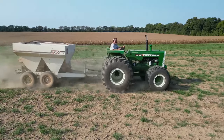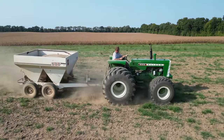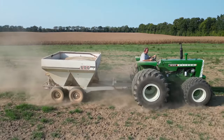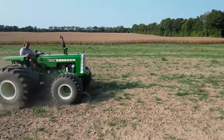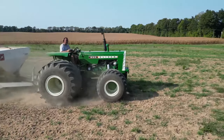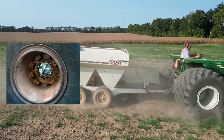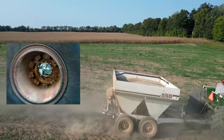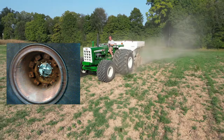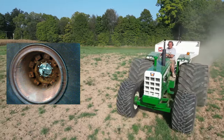But one of the things they did, I think when they switched it to the Allis-Chalmers 220, I should have a picture of that, is they added a second hub on the axle. It had to have been on the 220, because the 1650 did not have enough axle sticking out there to put two hubs on, especially the spacing they had it. But they welded a bunch of plates on to meet up to a second hub on the axle. I'm guessing they figured that would make it less likely to break axles, less axle stress.